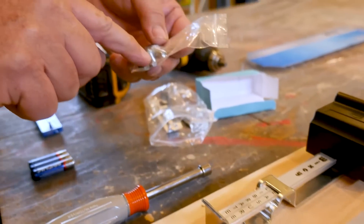Make sure before you go to the next step that this is absolutely level with the adjacent side, or a little bit higher — make sure it is not lower than the table or you'll end up with calibration problems later on. After you remove it and have your setting where it needs to be, carefully remove the paper backing off the adhesive tabs, then place it back in position maintaining the right height above the table. Press it in place using the frame, not the front gauge. It's now in place, but do not rely only on the tape — we need to mount it with screws.